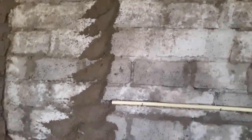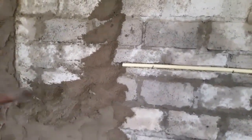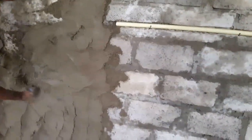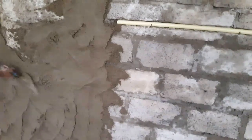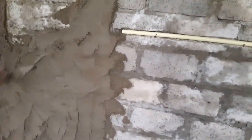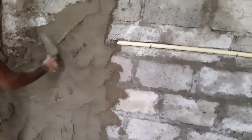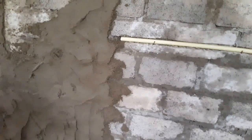After fixing dots, vertical strips of plaster also known as screed can be applied in between the dots. Then you can start applying plaster throughout the screed keeping an even thickness. Always follow the hand movements shown in this video because it will make the work easier.